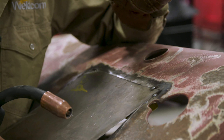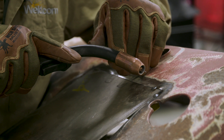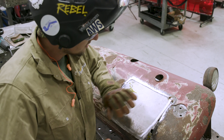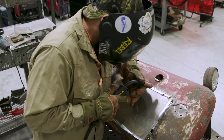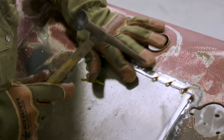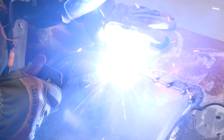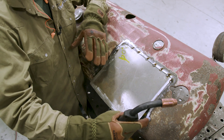You notice there I blew through — so it's called a bridge. I put a little bit on the left side and a little bit on the right side. I made sure I let it cool for a second, then just kind of moved my gun back a little bit and connected it. Then I want to get off of it really quick. The main thing is keep it flush. If we get it high, we're going to tap it down with the body hammer. So I'm just going to tack like an inch up, move up another inch. That's a little uneven — so you just try to get it even best as you can. When I get down to the bend, I'll show you guys how we're going to do that.